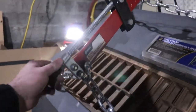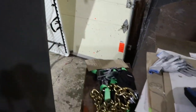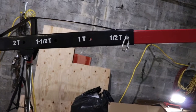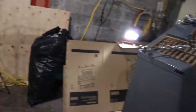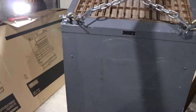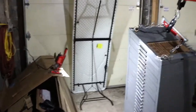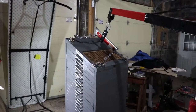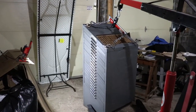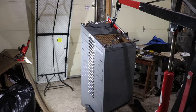The engine adapter is pretty good — you can use an impact gun to move it around if you want. Right now I'm set at half ton, which is a thousand pounds. This cabinet weighs around 600 pounds I'm thinking, so I'll start lifting it. I'm going to move it across the room and put the cabinet on a scale to see how heavy it actually is.